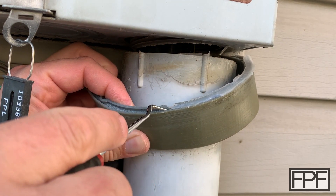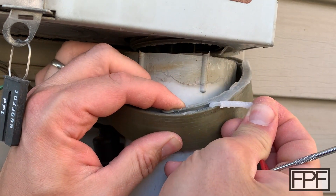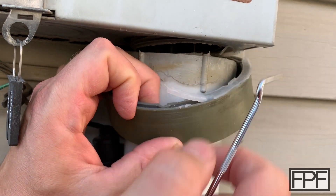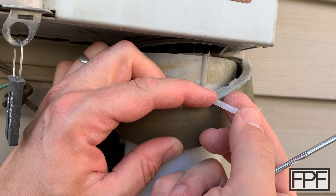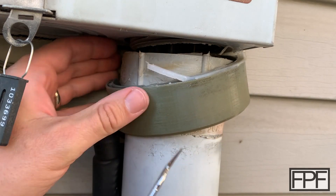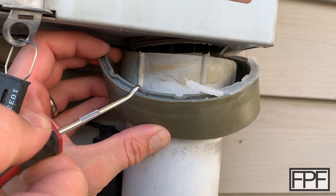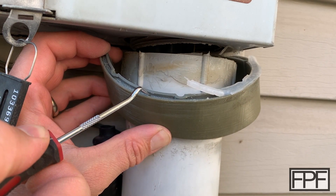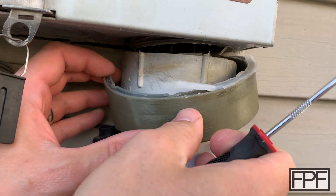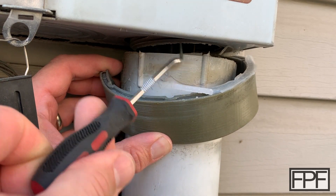Adding that groove really did give this quite a bit of adhesion. You can see it's bonded really well to that rough area down there — or maybe not so much bonded, but when the caulk set, there were lots of little areas for it to grip once it couldn't flow anymore. I'll often do this in my designs where I'll add a feature like this just for adhesion with caulk or shoe goo or whatever I'm trying to use. If this was just a smooth flat surface, this wouldn't have stayed up here at all. What failed was not the caulk to this surface here, but the caulk to the surface of the box up here.